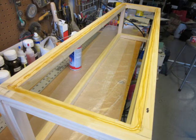Once all six masonite panels are set, and by the way, make sure to index these so you don't lose track of which one is which and which way they go in. I always make little pencil marks and I usually number the panels, like 1, 2, 3, 4, 5, 6, or whatever, and then put a little X in one corner of both the stringer frame and the masonite to remind me which way they go in.